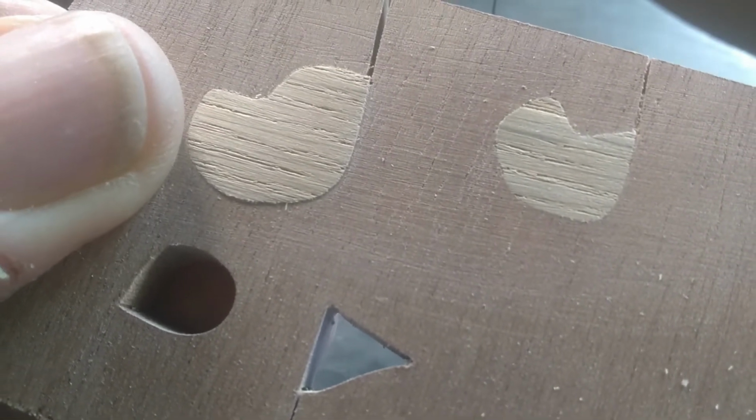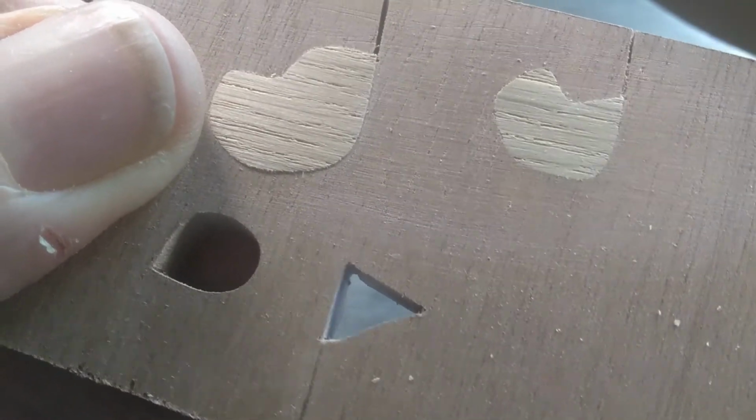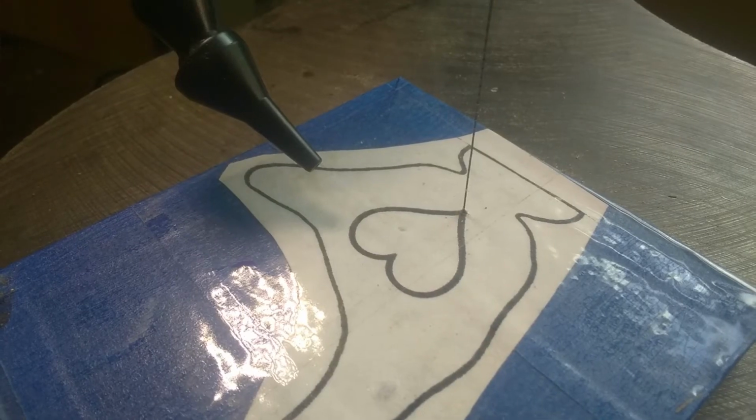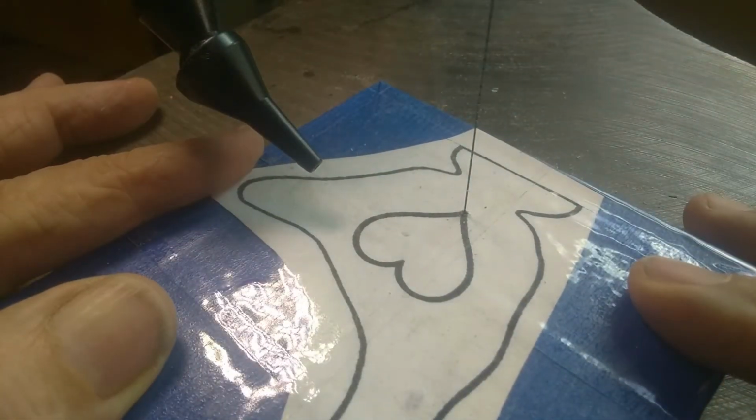And in this case, I had the light material on top and the dark material on bottom. And I cut in a clockwise direction. So that tells me that my angle is correct, and also that to make this cut, I'm going to have to cut in a clockwise direction. So let me get this thing threaded through the piece, and then we'll cut it. Okay, so we're threaded through. I've got the blade in tensioned.